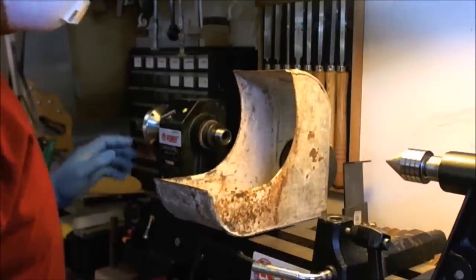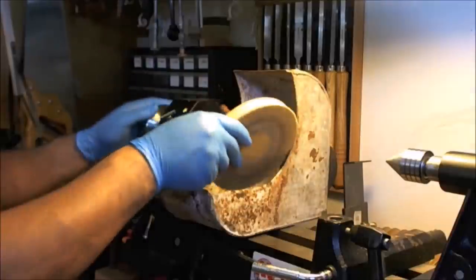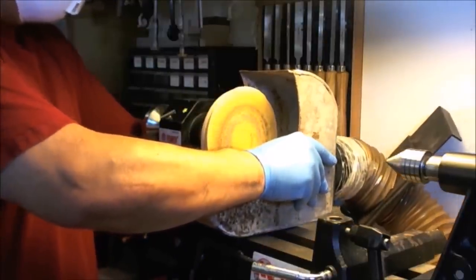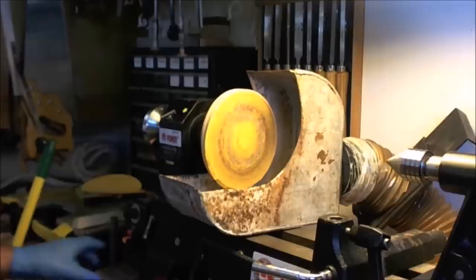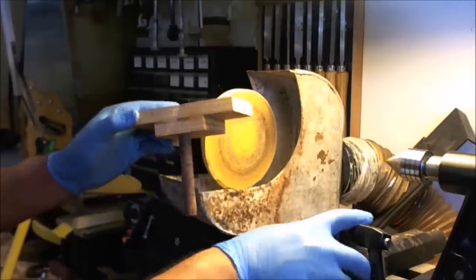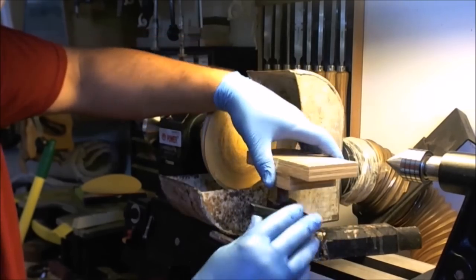And then for a disc sander, I have a 6-inch plywood disc with an M2 taper. And that's just going to go right inside there. And then I'll hook up my dust collection. Voila, there's the disc sander on my lathe. So I'm getting multiple purpose. This is just a generic tool rest that goes in the banjo to do your sanding against. Oops, make sure that's in the room.